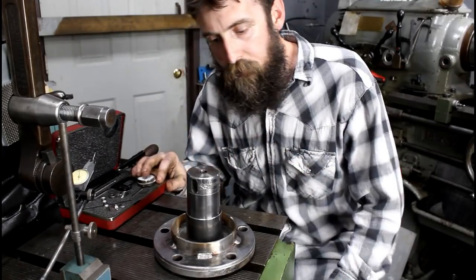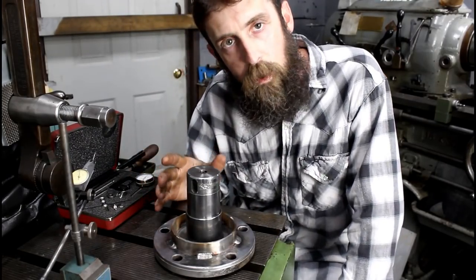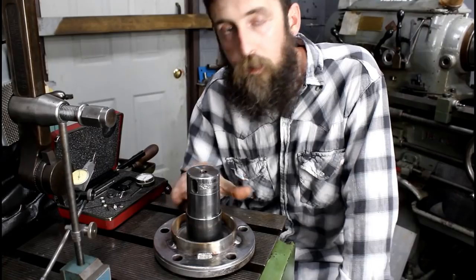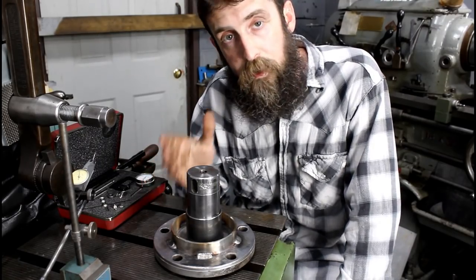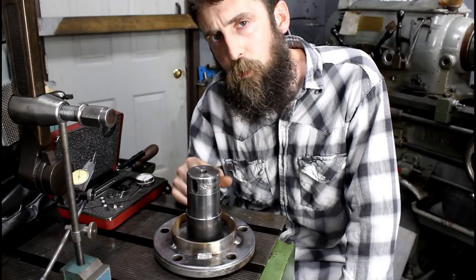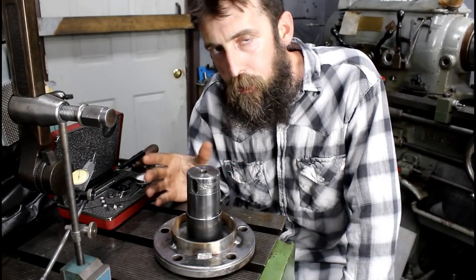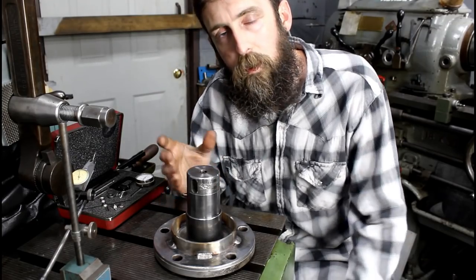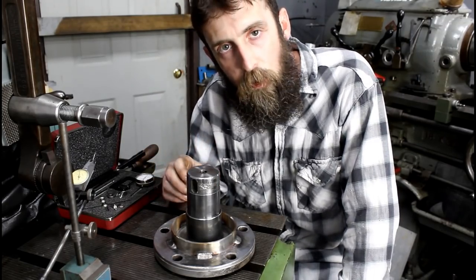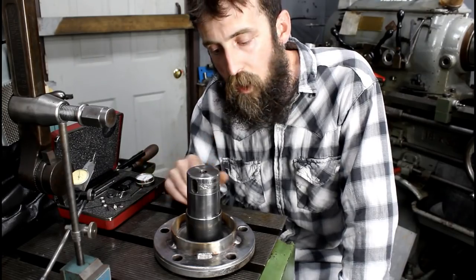I mean, if I had to change anything, I would probably go a little less aggressive on the press fit. We went for 2000s, and I hit my numbers, and that's what we had, a 2000s press. But that tubing was pretty thick, and I didn't heat it. If I had to do over, I'd probably take a propane torch and heat that a little bit before I pressed it on, because it was not real hard to press, but harder than I would have liked.